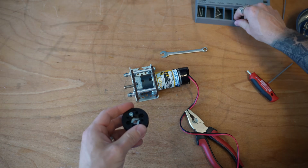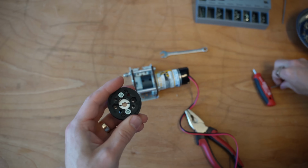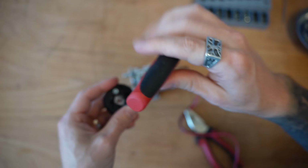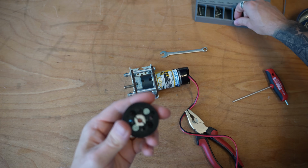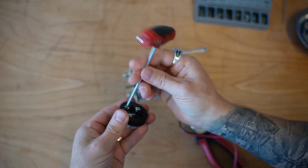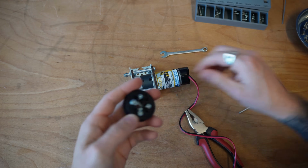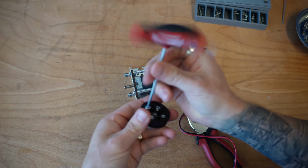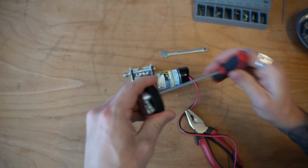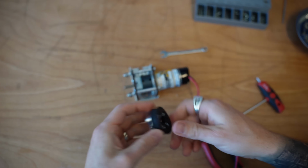You're also going to want to make sure that for your Sonic hub, you are using a threaded version, not an unthreaded version, because they do come in 2 flavors. Again, not a bad idea to Loctite these. Not as important on this part though. It's likely this won't be coming undone. Check you didn't use any screws that were too long to go through the Sonic hub.